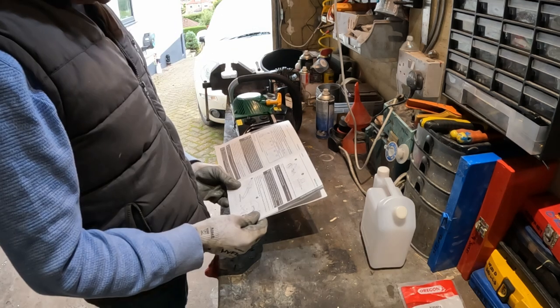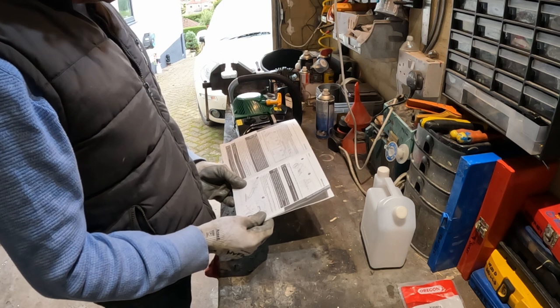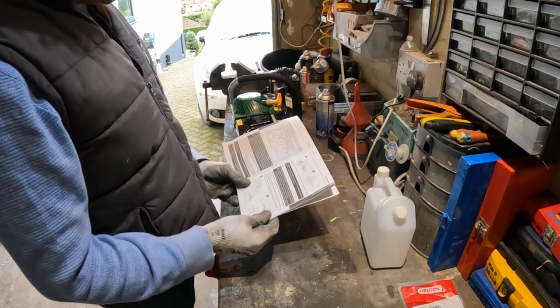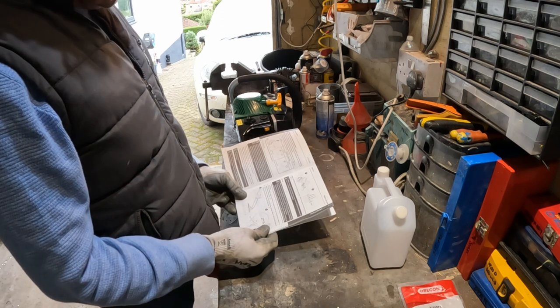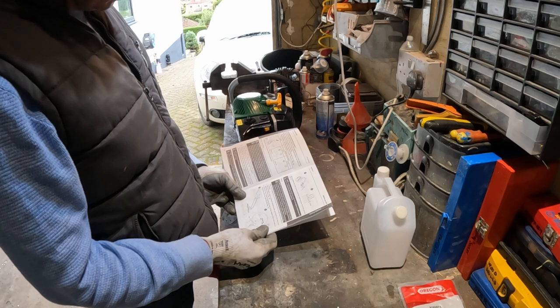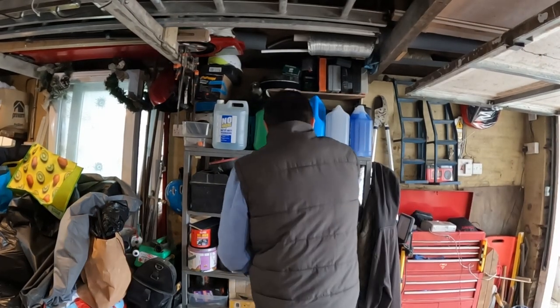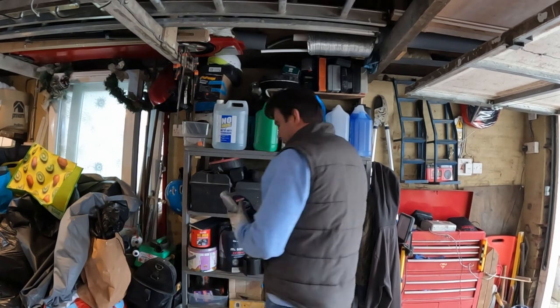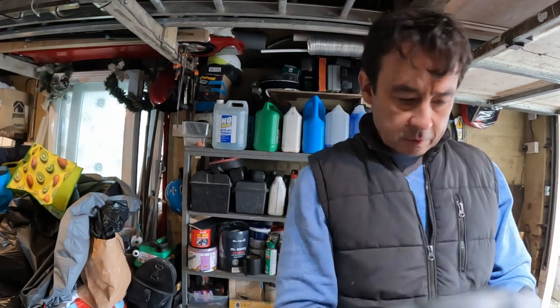Chain lubricant — the product is not filled with chain oil. It is essential to fill the product with chain oil before using. Never operate the product without chain oil. Use lubricated oil SAE 10W-30 all year round. Looking here, I've got 10W-40 — that'll do, that was lucky.